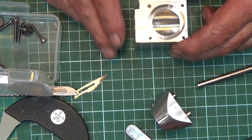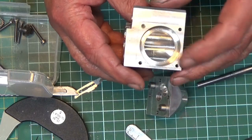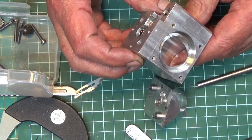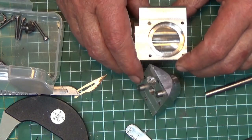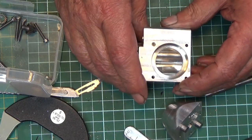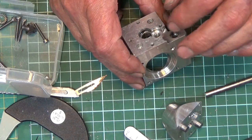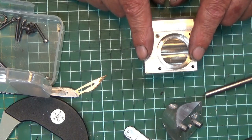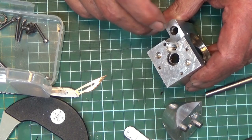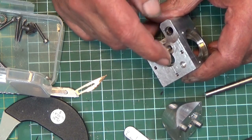Right, what we've got so far is the crankcase in part. As I say, this is the Whittaker Firefly crankcase basically, and what I've done is added this lobe to accommodate a camshaft, and so everything else is my design. Basically, I've extended the length of this block by 8mm: 4mm to accommodate the bearing for the camshaft, and 4mm to accommodate the embedding of the gear train.